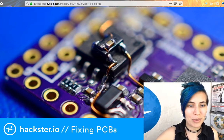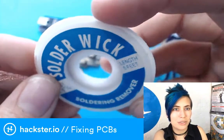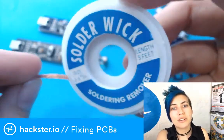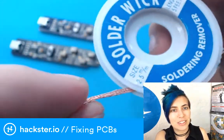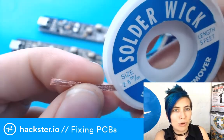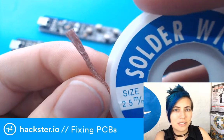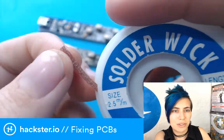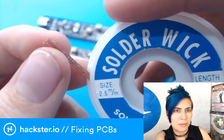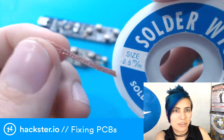I want to show you what I'm talking about. Solder wick is this stuff that you use if you mess up while you're soldering and you need to pull off some of the solder. It's useful, for example, for removing headers, or you have a bunch of solder in a row and there's no way you can heat the entire thing at once except with a heat gun and maybe mess up your circuit, to get the whole row of headers off. So you go down the line with this solder wick and apply it along with heat. And the copper is so conductive relative to whatever you're soldering that it'll just pull the solder off with a little bit of capillary action, I think, as well. And then you snip off that bit that is now saturated with solder and you go down.